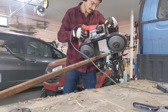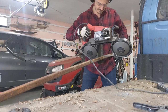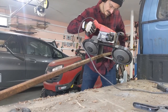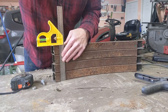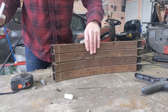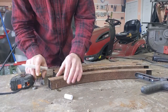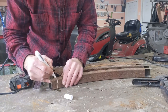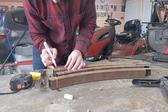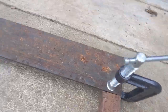I'm cutting up this square tube for the top of the plow. It's nice that I have this portaband — I have a stand for it, and I can just pop it off easily for weird cutting situations like this on long stock. Here I measure for cutting the slots for that top three-quarter-inch square tube. And here's the dry fit on what that looks like.